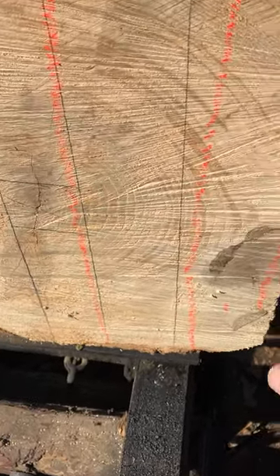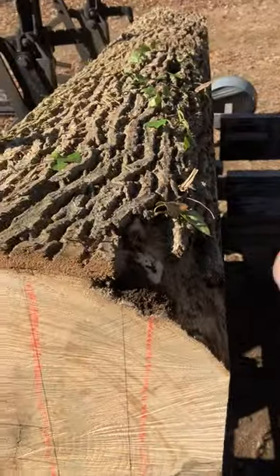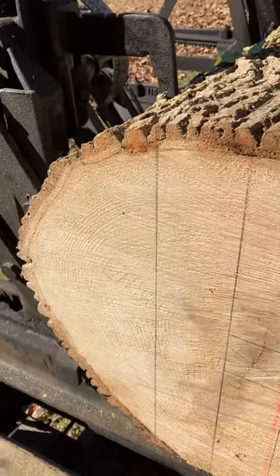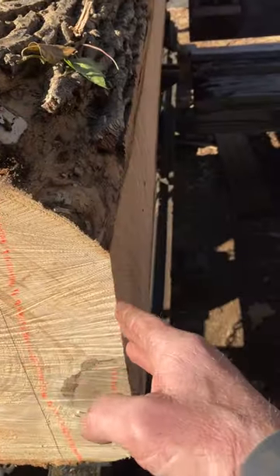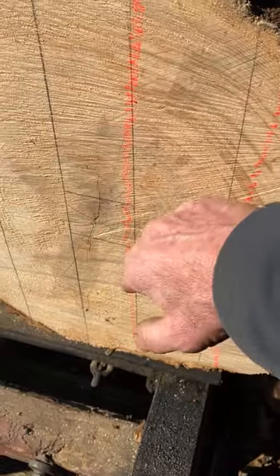What I've done is I've measured from this point to this point and adjusted to the back with the taper attachment here. So after I clean up this cut, they should be the same distance from here to here, so then I can go in there.